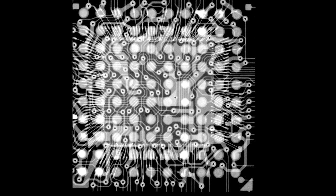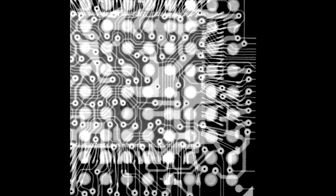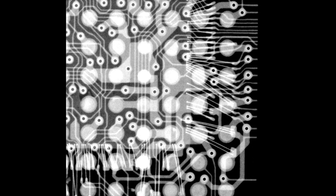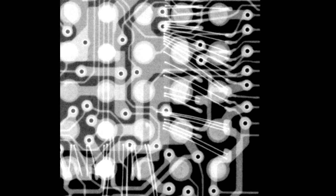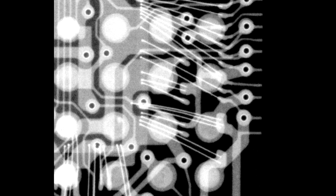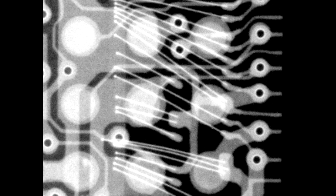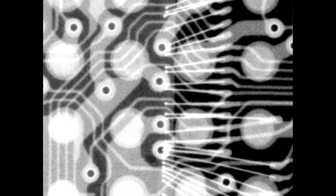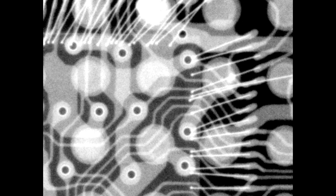While I've got the x-ray machine going, this is an x-ray of the ARM chip with its BGA package. You can see the bottom is basically a PCB — you can see the die in the middle with the bond wires bonding out to the pads just outside the outline of the die, and then tracks on the PCB and through-holes routing those to the positions of the balls. You can also see these pads going off to the side — that could be for test points, but the other reason may be for gold plating. For thick gold plating it's generally an electroplating process so you need to electrically connect all the pads together. So those pads off the side likely go to a ring to connect them all together as part of the gold plating process.